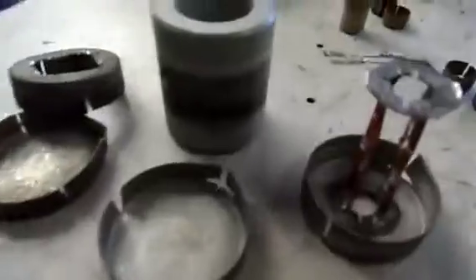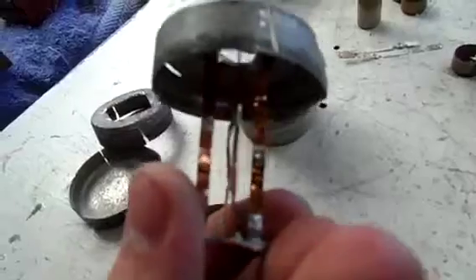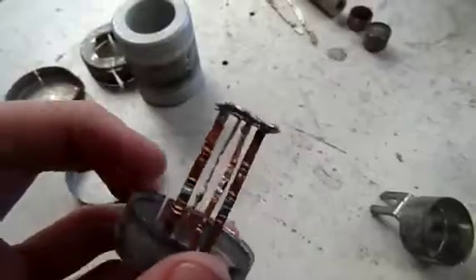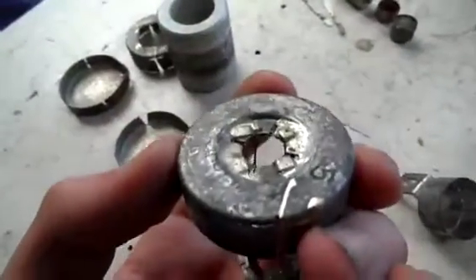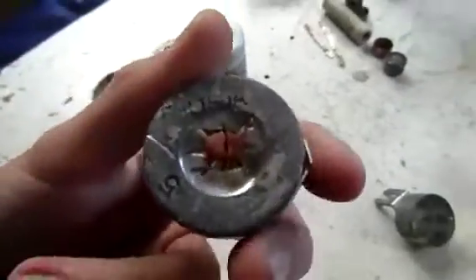Same deal — put a T-shaped cut and pull the caps off. That's our 150-amp fuse, not sure who made it but it is made in the UK. As you can see, fairly thick ceramic housing — the burning in there is just from my grinding, not from the fuse straps. There are four copper straps inside; if you type 150 divided by 4 into a calculator that'll give you what each strap is rated to. Each strap is soldered to the inner end cap, and it reads 150 amps as the rated value.